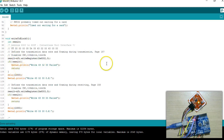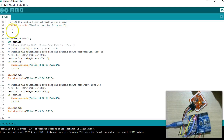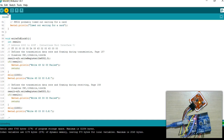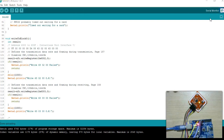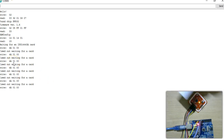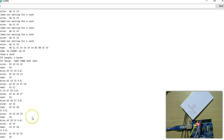Inside this function I typed all the sequence of commands we used with ACR122U. I am going to run this first to see it works, then I will spend some time explaining these commands. You can see I have got the PN532 mini board connected to Arduino using SPI connections. I am going to compile and upload. I will take a UID changeable card we have been using in the previous videos and place it on the reader and observe the serial monitor output.